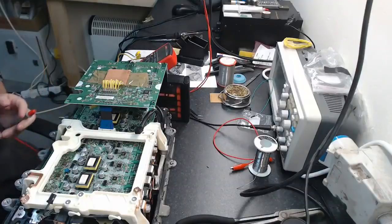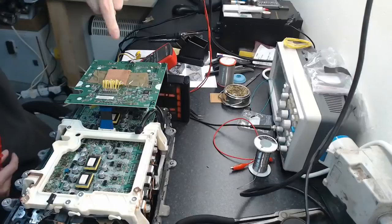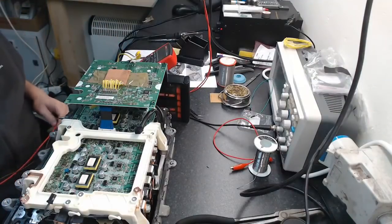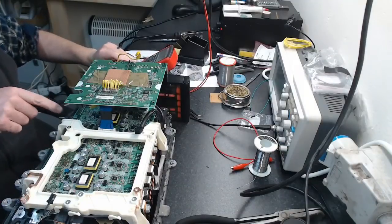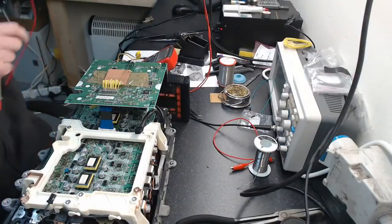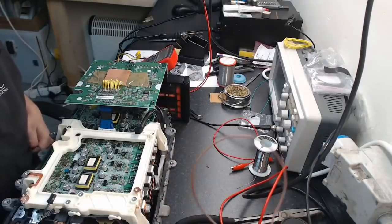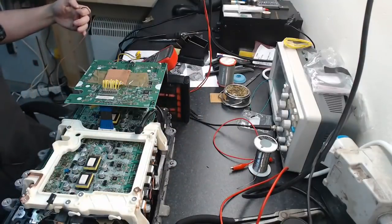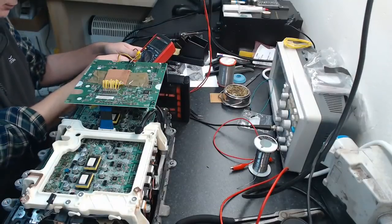E1, G1. Other option, right? Other way to do this is we go backwards. Rather than picking one of these and seeing which transistor it actually turns on, what we can do is pick a transistor here and then ripple the resistor to see which line turns that transistor on. That sounds a better plan, doesn't it? I get a little less chasing my tail then.